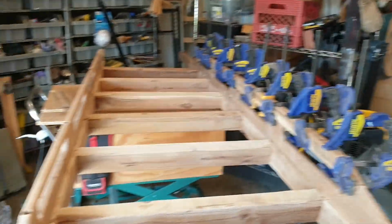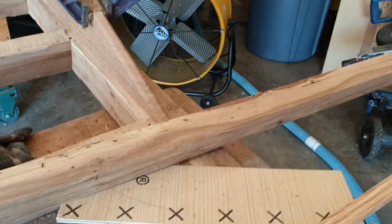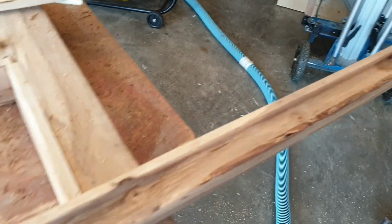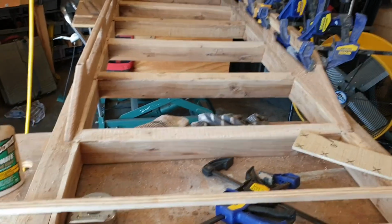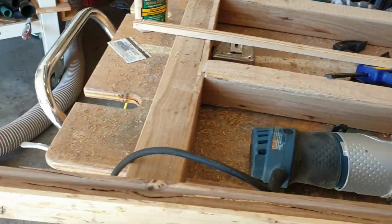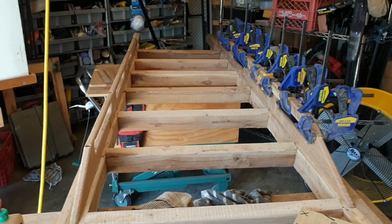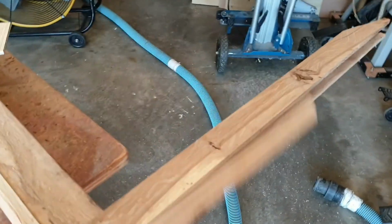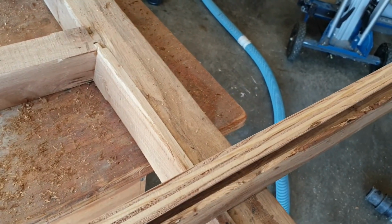All right, well, I decided I better stiffen up that top rail just a little bit, so I got two of the best boards I could get. They're still a little curved. I run a channel over the top of that, and it'll set over the top of that, and I'll glue it over, and it'll cover up the bolts down there, and put some glue on it and get it done. I've got to round off all the edges with the router and put this little shim stock in here to keep the router from gouging in, and so I'll do that and get that done.